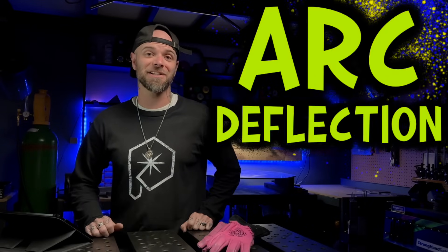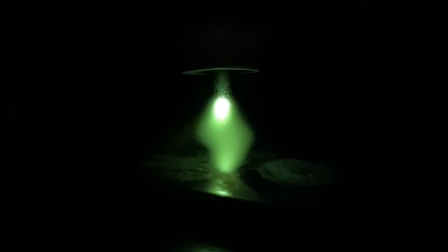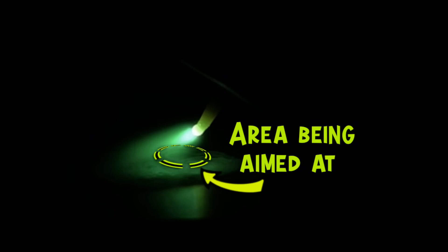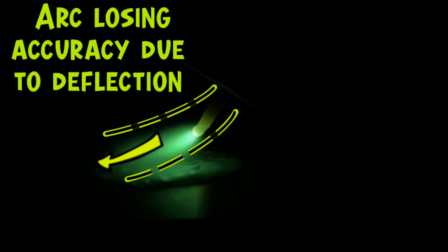This is going to give you something I talk about on my channel very often — arc deflection. Anytime you're welding at low amperage, you can see your arc starting to flicker off here and there, not locking onto the target you are aiming at. Trying to stay focused on an area you are trying to weld will basically be impossible with a tungsten that has a tip like this. So now we know some very common problems. What is the cause, and how do we fix them? Welding with some of this stuff may be completely fine at low amperage, but when we start welding with a little more heat, this is typically where the problems are going to start to arise.